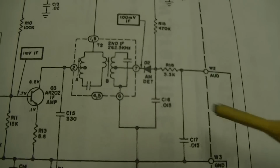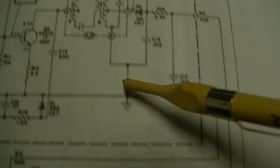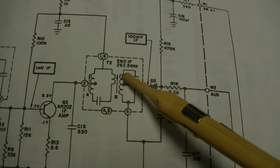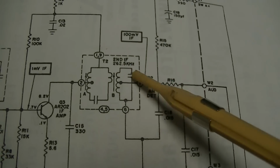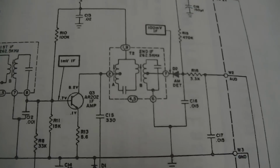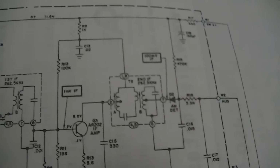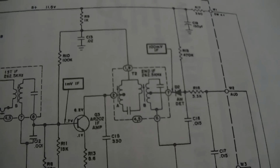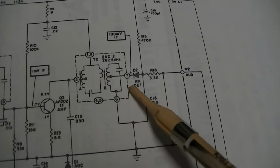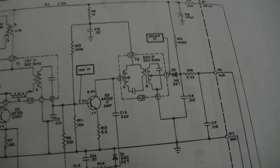So, all I was doing was putting a capacitor, 300 picofarad, from there to there, which is ground. That's assuming this one's open, but I can't get to this. That's internal. So, yeah, this is definitely gone. And adding that little 300 picofarad from there to there and then retuning this made all that difference. So that proves my diagnosis there. I might just solder that in there and peak it up and leave it and still go with my modification here. That way I still would have AM radio that kind of works in the event of an emergency.